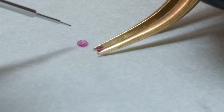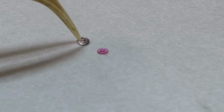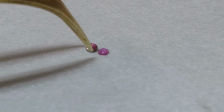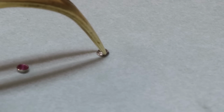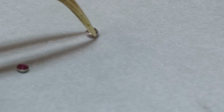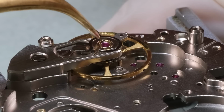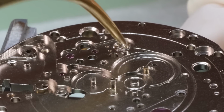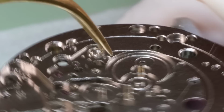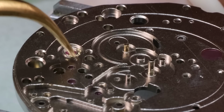And that hardness, combined with being very smooth and then a tiny little bit of oil, makes the pivots on the balance wheel rotate or oscillate very smoothly, with very little friction. Those little golden springs on top there that we close on top of the jewel are to help against shocks. So if your watch drops on the floor or you hit your wrist against the door jamb, then that will flex ever so slightly and thus avoid any damage.